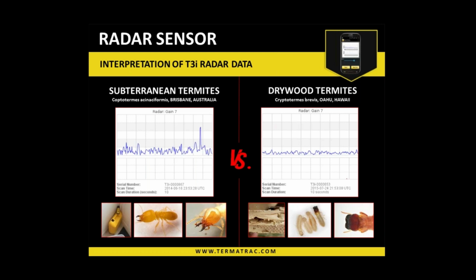Whilst we're doing that for the determination of termite activity, what it's also helping with is that it can rule out certain other issues which we may come across. Such as vibration. The vibration we can get is from electrical devices, so from fans, washing machines, fridges, air conditioning units even. They can send a mechanical vibration through the material that we may be testing.